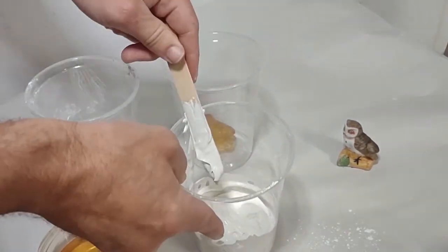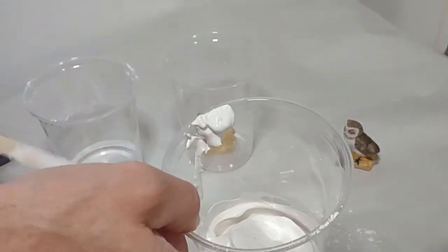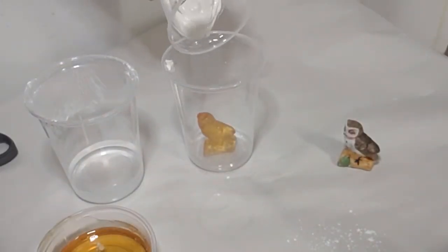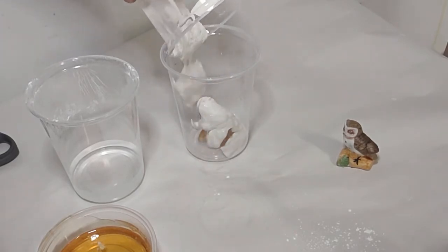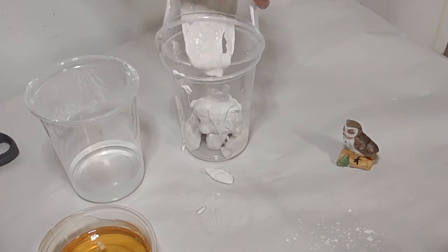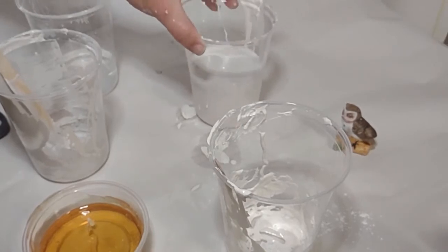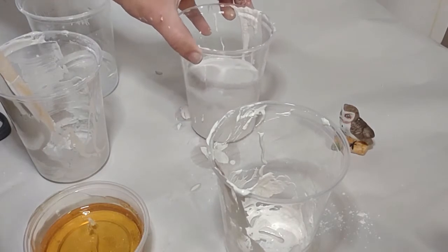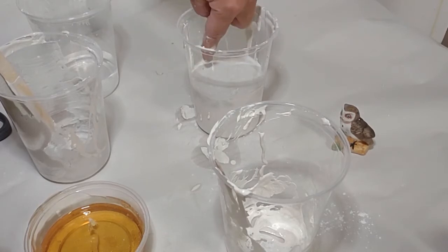For this casting we don't need a mold release, but if you did I would recommend using a vegetable oil. You can also use talcum powder, or even for plastic castings they suggest a soap of some sort. Now just put the plaster over the composite mold casting and let it solidify. I didn't mix enough plaster the first time, so I ended up having to do two mixes and combined them while still in liquid form. Tapping it allows the bubbles to rise to the surface and makes sure the plaster gets up and around all areas of the composite mold.